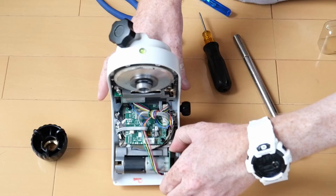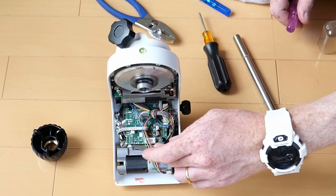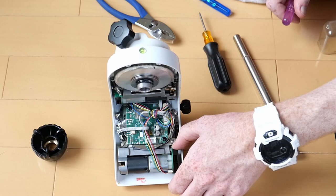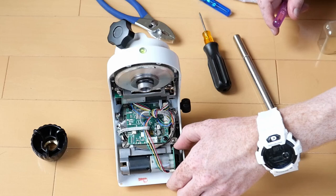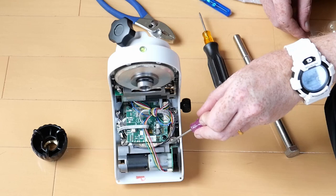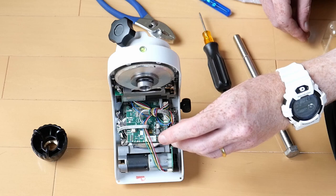This spring is not terribly strong. While spring-loaded gears can work magnificently well, I'm not convinced they are proper for this particular mount. I believe they are used to account for any asymmetries or eccentricities of the actual worm wheel. This system is not meant to be high quality like astrophysics mounts, but is meant to basically counter other mechanical issues. I kind of want to get rid of that system.